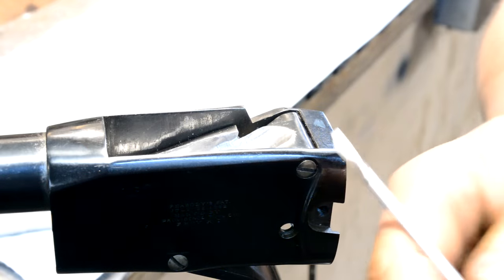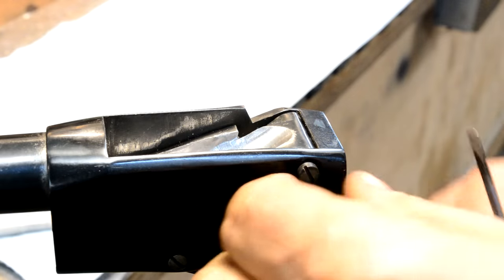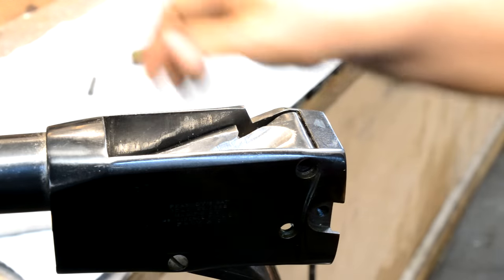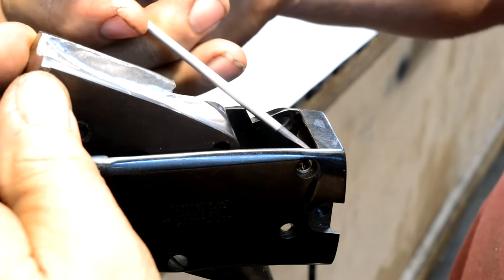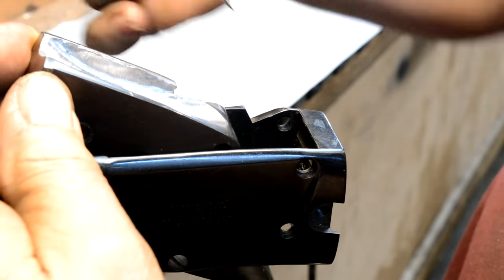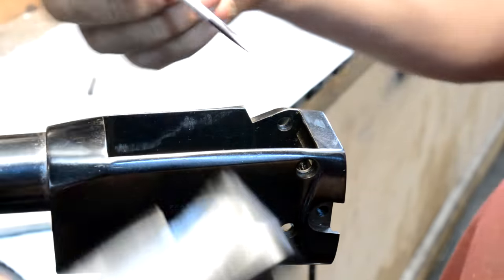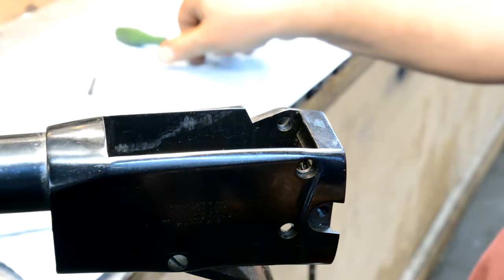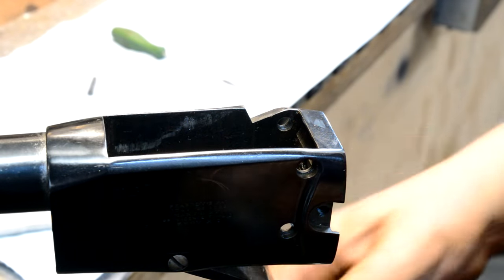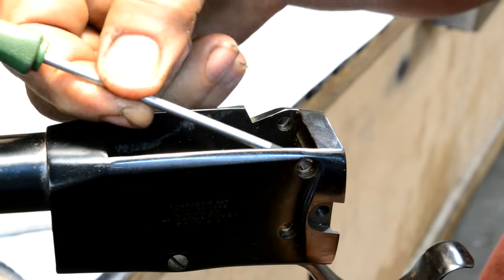So you remember the guy that shot the wall gun? Well, that crazy buck is back in the shop, and he asked a great question that I don't know the answer to, and maybe you guys can help me. How did they machine a segment of a circle into the back of this receiver with square corners here and here without having to come in this way? Because it's definitely cut this way. So all you guys out there that want to kibitz my machining, maybe one of you bright bulb guys will tell me how in the heck they made that cut.